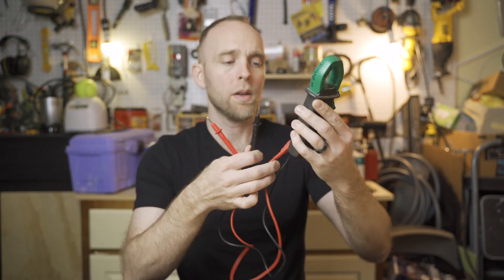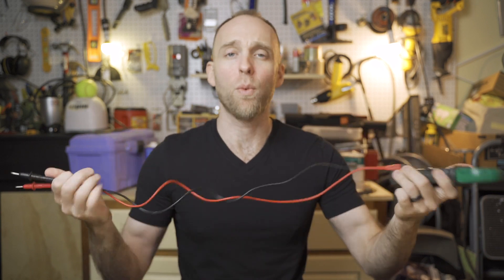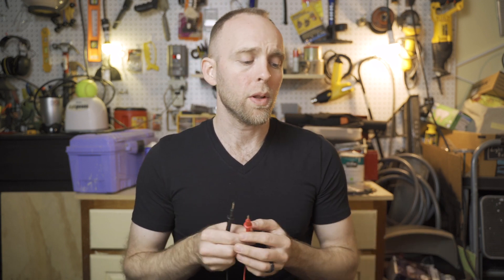Find the Omega symbol and put it in that mode. Your multimeter also comes with two leads — usually red and black wires that you attach to different ports, sometimes only two ports, sometimes four, but usually only two. So when you're in continuity mode, your multimeter will provide either a visual or an auditory signal to let you know that there's continuity between two points. If we take our multimeter and have the audible alarm on, when I take my two leads and touch them, I should hear something like this.